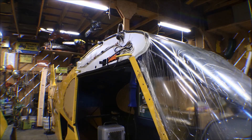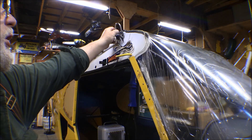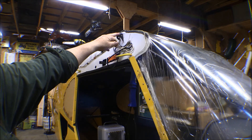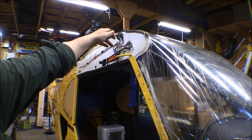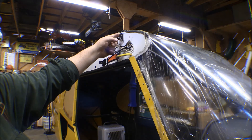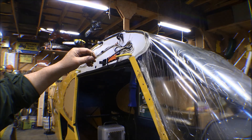Some of the drawings are kind of rough, but all in all it's pretty good. However, it doesn't show any of the hardware you need to assemble this — the bolts, nuts, screws, and things like that are shown in the parts book. The exception is the tail: the horizontal stabilizer and elevator surface back there are shown pretty well with a hardware breakdown. And the other exception is here on this wing hinge where the wing attaches to the fuselage. It does show these bolts. This forward wing attach fitting calls for an AN5-17A bolt with an AN365 fiber lock nut, and washers as necessary to fill the gap between the hinges and the spar. The rear hinge calls for an AN5-16A bolt.